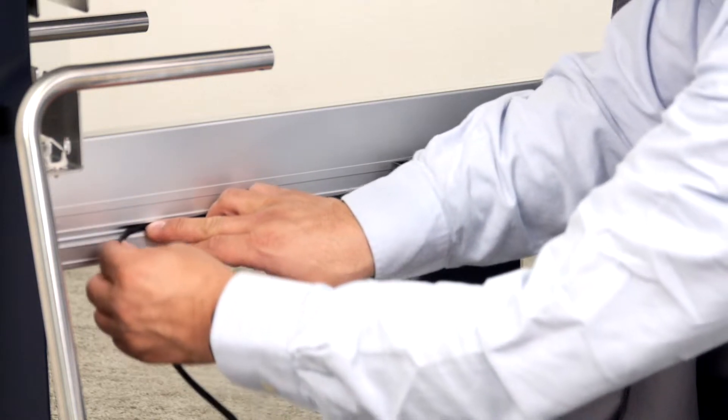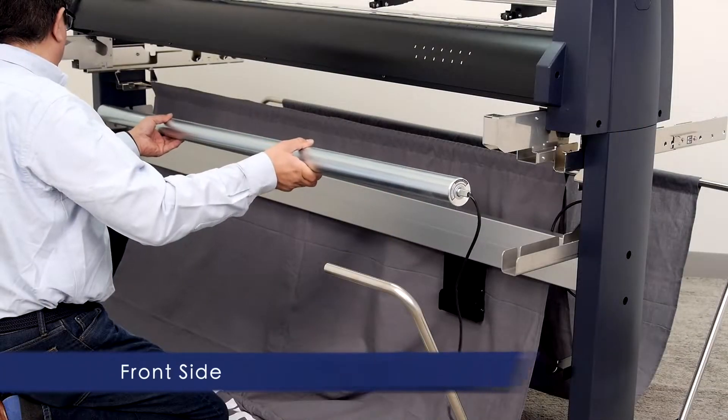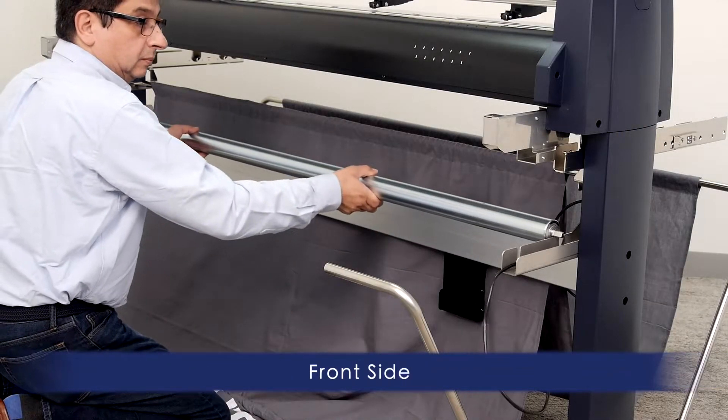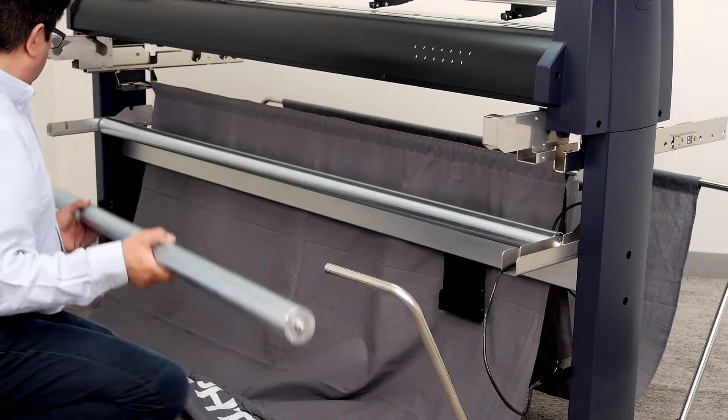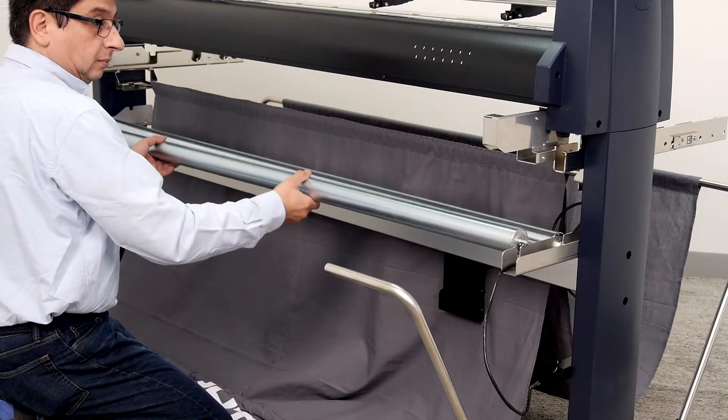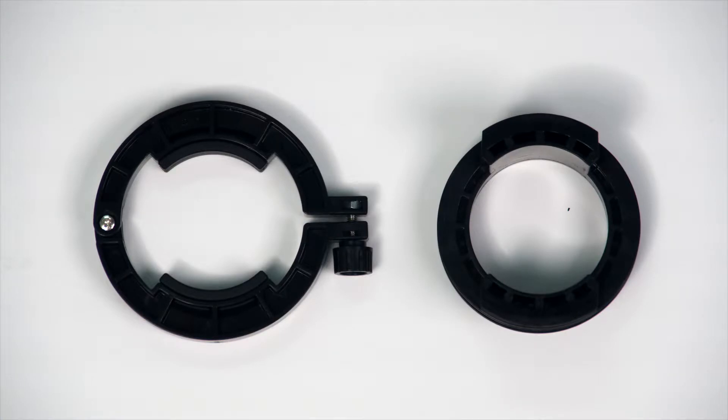Replace the basket. Place the drive roller with the attached wires into the back slot of the roller bar bracket, and then place the other roller into the front slot of the bracket. Your next step is to install the flange guides onto the roller bar.